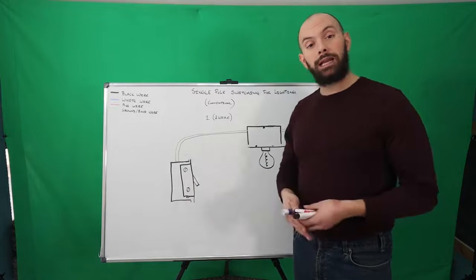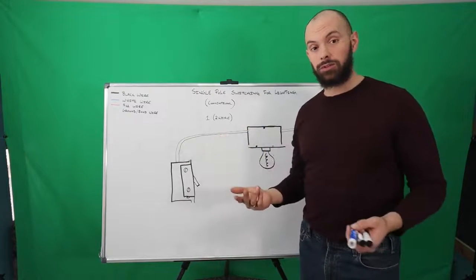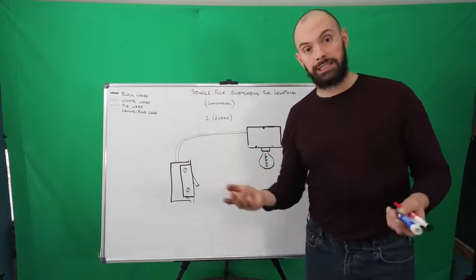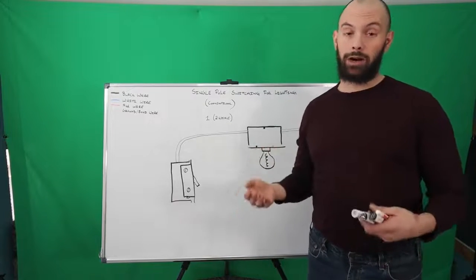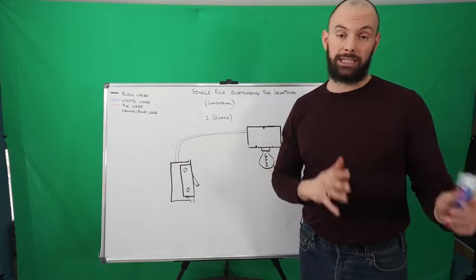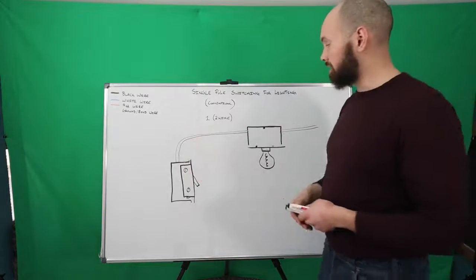And what does that mean? A two-wire wire has two insulated cables. It actually has three wires, but only two are insulated. That is your black and your white. The ground wire is going to be a bare copper unless you're getting an insulated ground, and then that's a different type of wire altogether. But sticking to the basics.